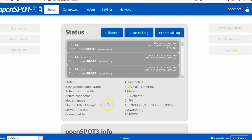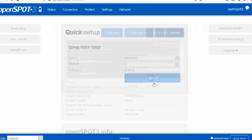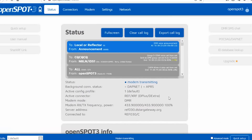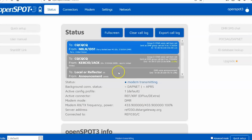The way this works is it routes incoming traffic to a talk group. For instance, with a DMR radio to a D-Star reflector, all calls are routed to — in this case — talk group 9. Your radio on that channel will be on talk group 9, and everything coming from D-Star comes into the Open Spot 3 over Wi-Fi through the network, then it sends it to your DMR radio on talk group 9. That's how the hardware or software cross-moding works. Same thing with DMR to Fusion — it takes your Fusion audio, brings it into the Open Spot, and puts it out on a DMR talk group.